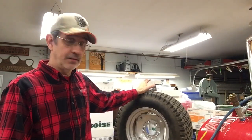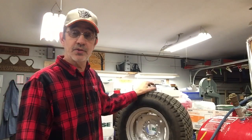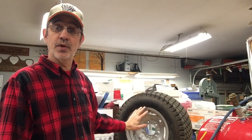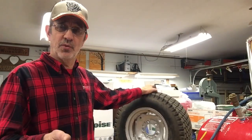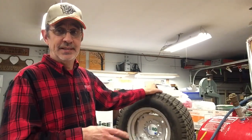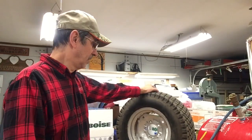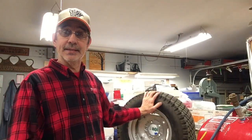That's how I put weight in the rear end of my machines when I want it — I don't have to worry about it freezing, and it's super cheap. Anything else you buy — they're now selling beet juice to put in these tires because it doesn't corrode and rust the rims out. It's cheaper than chloride, which is what they mixed with water to put in these things. It rusted the rims out terribly on old tractors, so they came out with beet juice. Or just put a tube in it and eliminate all those issues.